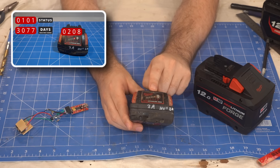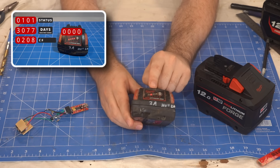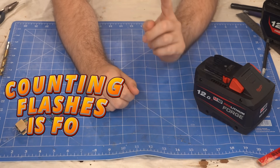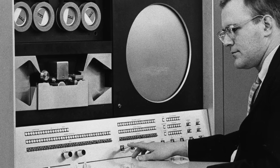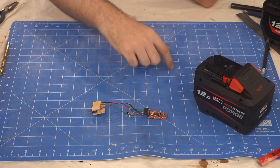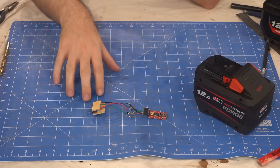You may have seen the flash code trick that was revealed by myself and Tools and Stuff last year. Well, you can get rid of that because counting flashes is for peasants. We're making a giant leap forward to the 1970s and using UART communication, which uses a sequence of high and low voltages to represent a number.